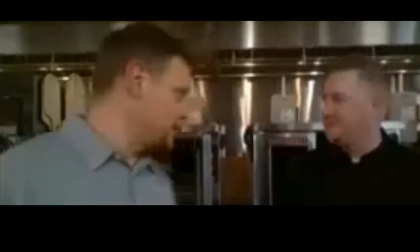So I've seen a lot of times where we have aluminum foil or cellophane covering something because we want to keep moisture in. You got that roast, you want to keep the juices in there. Sometimes you go to your local discount giant super center and get a tray of 10 stuffed peppers and you want to throw them in there. And they say to cover with aluminum foil. Well, if you do it kind of loosely, that aluminum foil is now going to fly around in there because of the fan, and that gets sucked up into some of the components. One, it can get sucked into the fan grate located inside the oven cavity. We will have a fan grate located inside there.